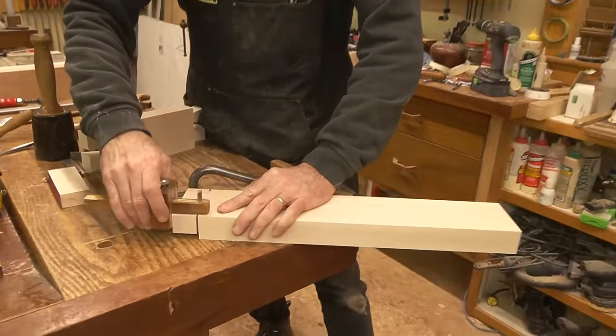This is a good project to sharpen your chisels before — they're all important, but you gain such a benefit. That looks pretty good. I want to make sure I don't have any mound of material in there. I can see my chisel is hitting flat there and flat there. If your chisel laid across is rocking, you've got some high material.